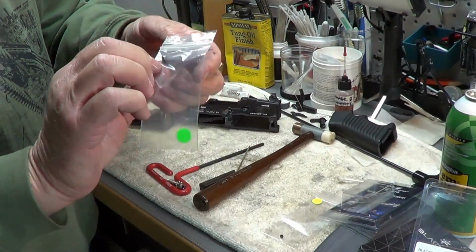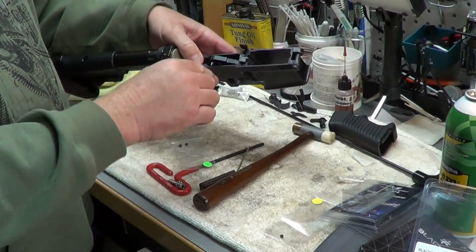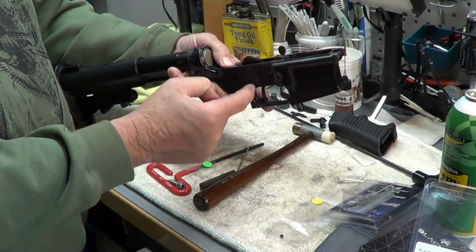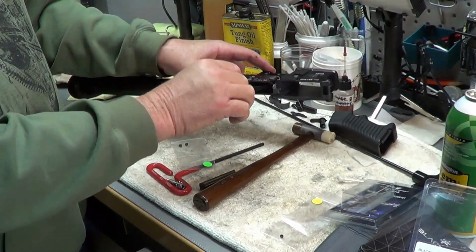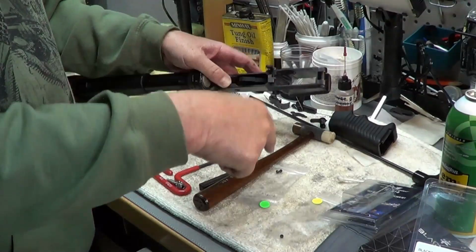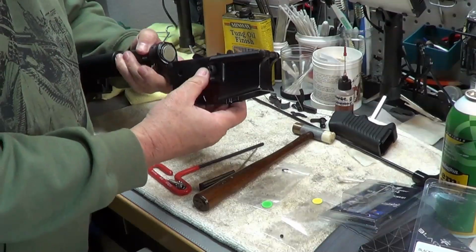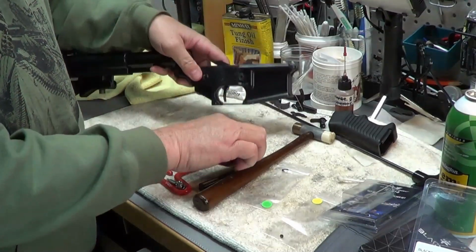These 2 are safety backouts. I would screw these on top of these 2 screws, so these screws that I just screwed down will not back out. So basically these are safety screws that go on top that I should put some Loctite on, so this will not loosen up as I shoot. I don't think this is going to loosen up.